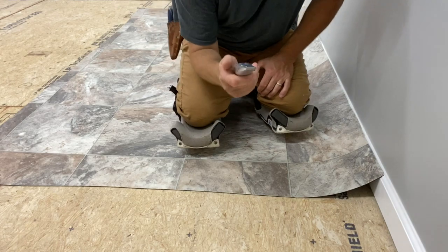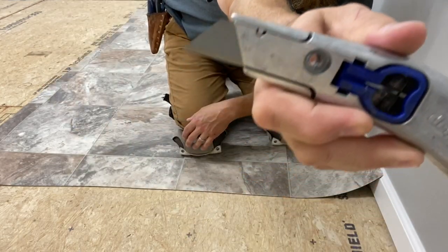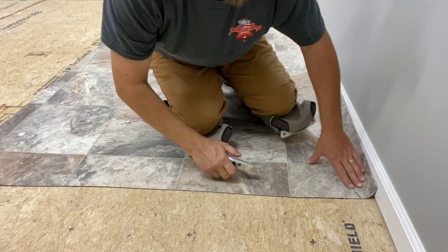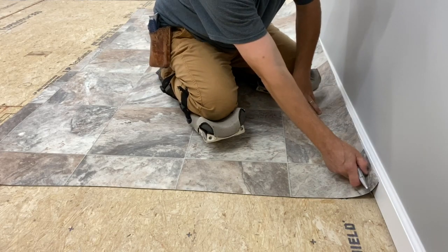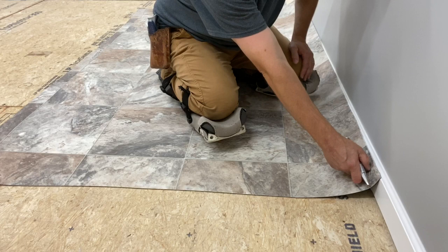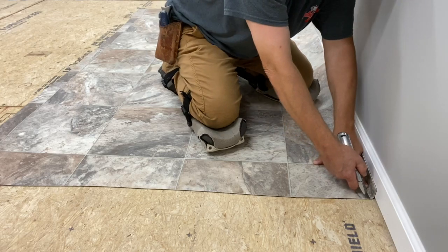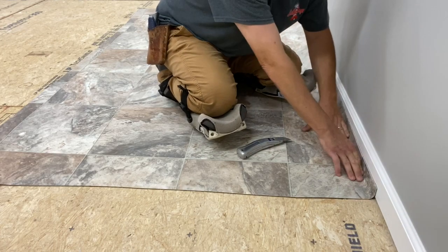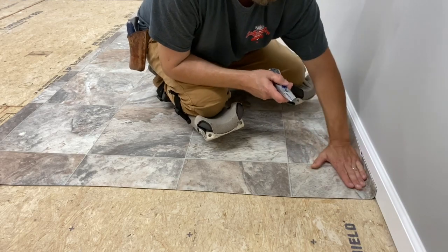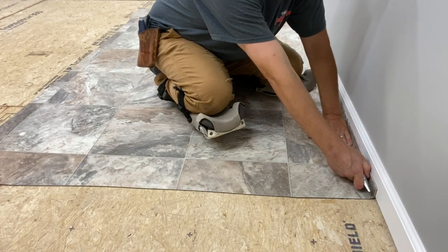So let me point you down right here and we'll go on with it. Typically if you use a traditional utility knife - this is a little bit of a different utility knife, but it has the utility blade in it anyway. Whenever you're trimming your vinyl down, you always want to make sure that it's in the crevice right there really good. You don't want to just hold it right there and commence to cutting. I will generally take my one hand right here and crease it in front of me. Notice my finger is right here. I'll take and push it down with my knuckles as I'm doing that.